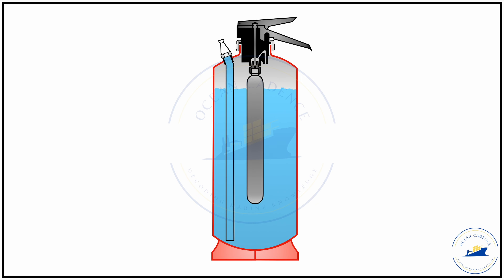As seen in this design, the discharge nozzle is at an angle to the perpendicular, which is why when using this extinguisher it must be tilted up to 45 degrees from the normal to ensure direct jet impingement of the water on the base of the fire. When tilted correctly, the water type extinguisher achieves a discharge criterion of almost 95 percent of the total water quantity being expelled out, which is as good as the efficiency of the other extinguishers.